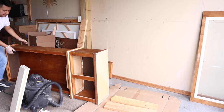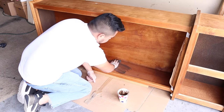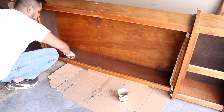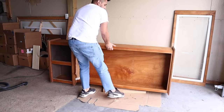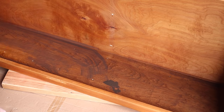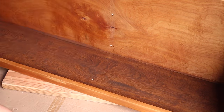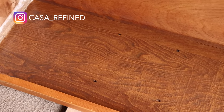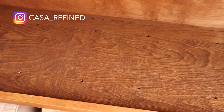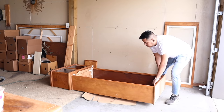I will be staining the interior of the cabinet first with that stain mixture I just created, basically just to cancel out those orangey slash golden tones — which it did. I'm turning the cabinet on its side here just so that the stain goes on nice and evenly and does not drip down, which is an issue I've had in the past, and this definitely worked. The tones kind of look orangey on camera, but it's not — it looks a lot more neutral in real life.